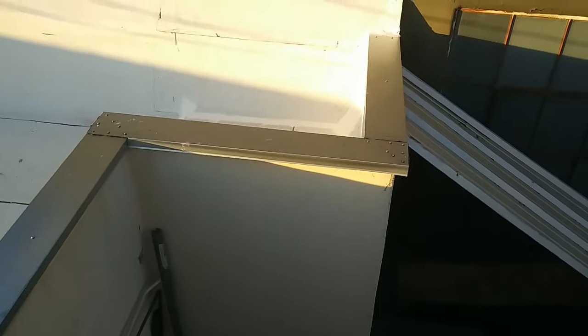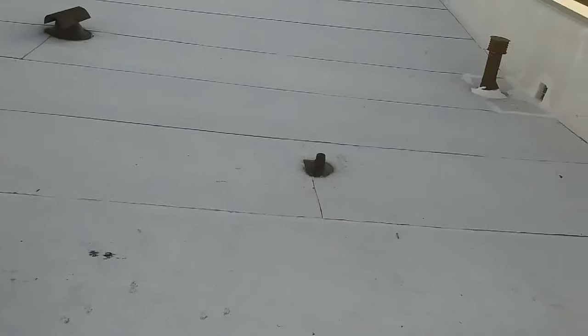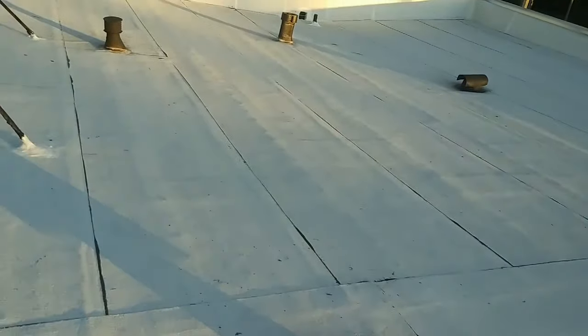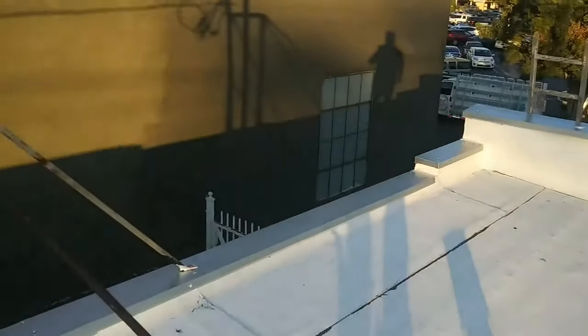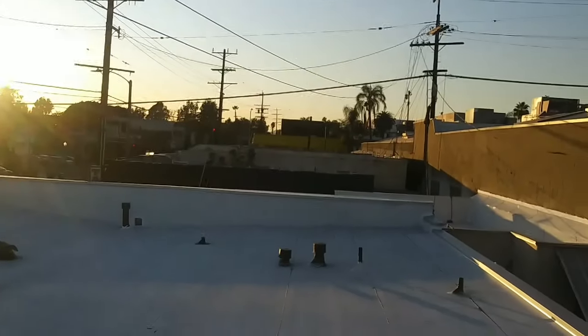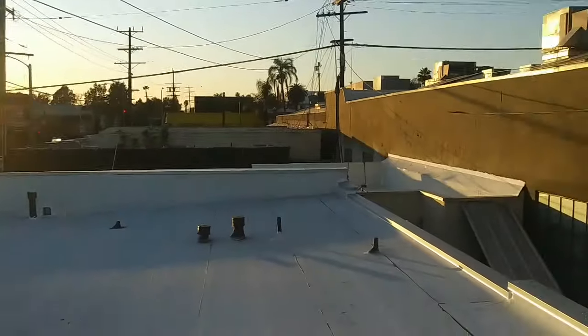New coping metal — coping metal over here is 2x8x2, that one in the front is 2x12x2. Coping metal is good because it helps the roofing material not deteriorate on top of the wall. I'm telling the owner: when they replace the roof on the church and the other place, both locations, they have to put some coping metal too.